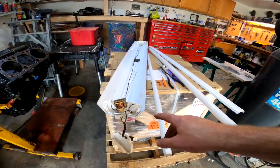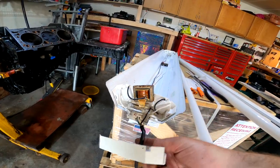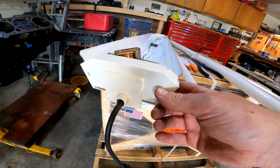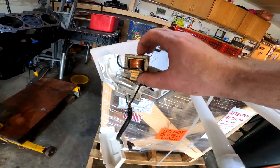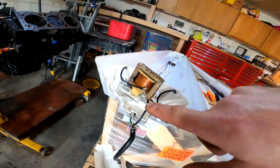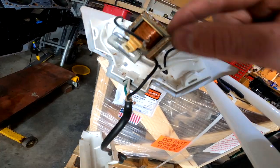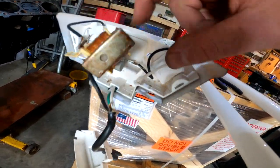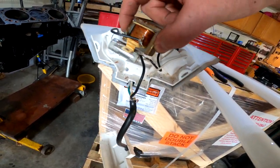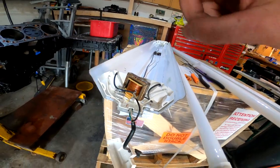All you do is remove the ballast. You pull these covers off on both ends — my shop lighting had covers on both ends. There's a ballast, a condenser coil, and another component. The black wire connects there, and the other black wire for this side connects there. You just cut the black wires off the ballast and splice all the black wires together on both sides.